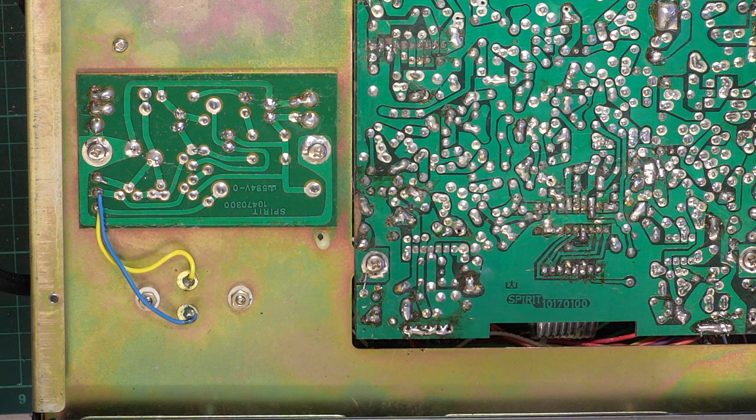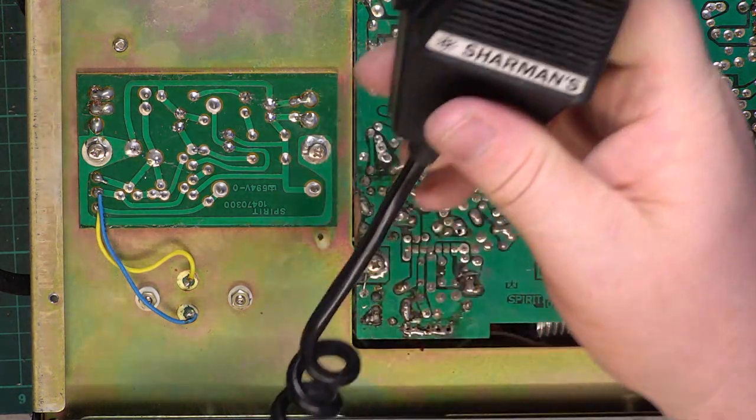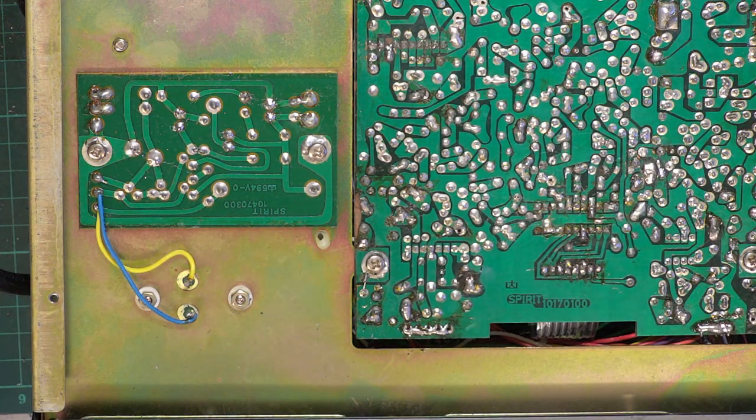Now, there's no need to upgrade them to 105 degree centigrade rating. I probably have done, because that might be what we have in stock for the 1 pence they cost more. At factory level, if you're making 5,000 items, it makes a difference. But at service level, you may as well just stock some of the better ones. I've had to use the 1,000 microfarad electrolytic out of an RS supply, so that's a bit more pricey than the consumer standard. So I've no reason to think that that isn't done right the other way.